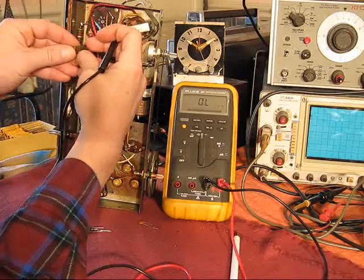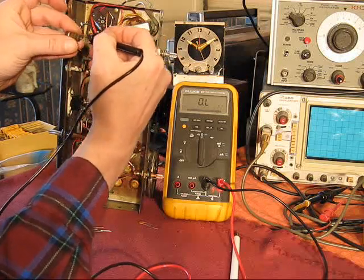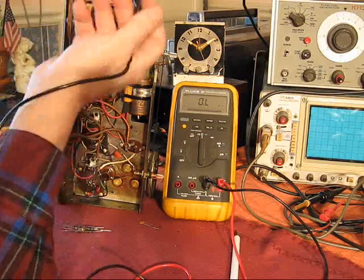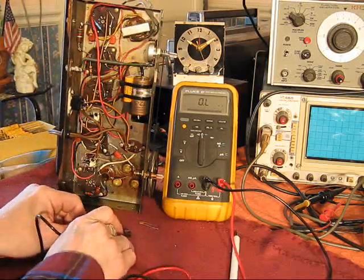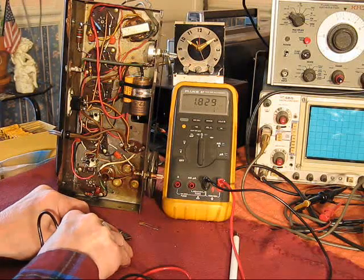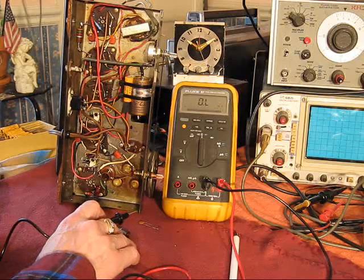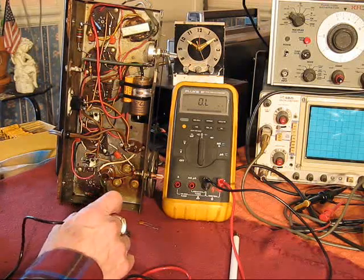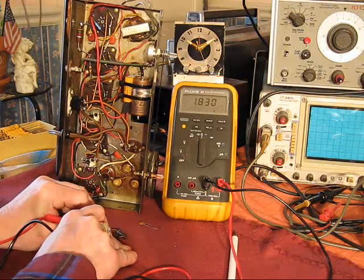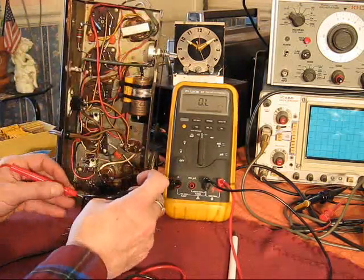So, looking very closely at this thing, it's got what look like cracks in the molding. And clearly the resistance is out of spec, 1.829K. Well, 10%, that should read anywhere between 1.350 and 1.650K. He's gone. As I said, that resistance will probably work just fine in there.